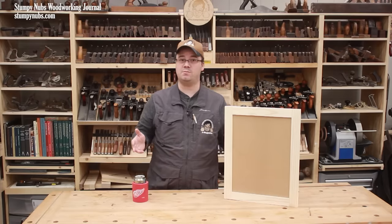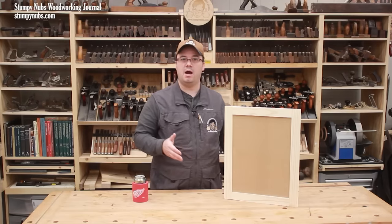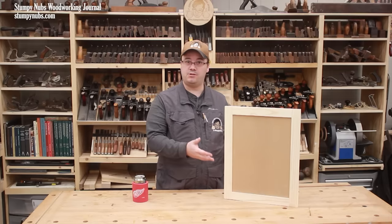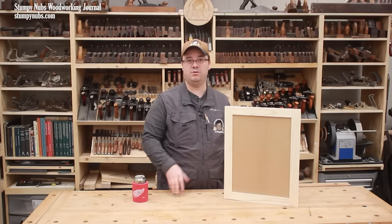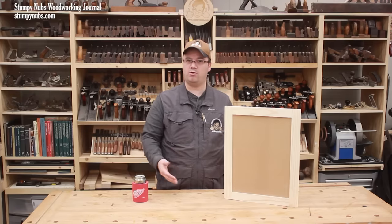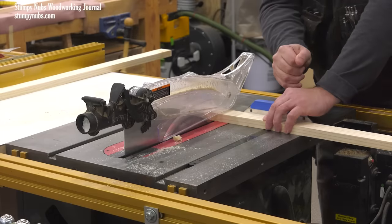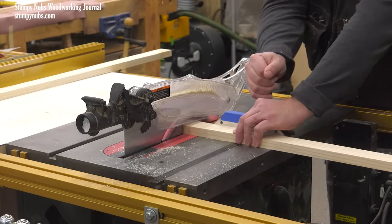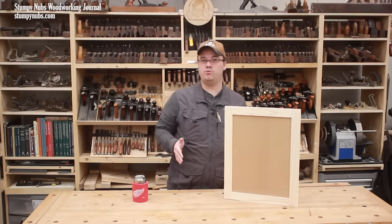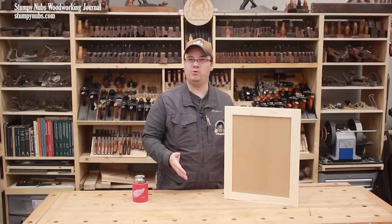Poplar is still a little too soft, especially for kitchen cabinets that you want to last many years. If it's available to you within your budget, a hardwood like maple is an excellent choice for natural stained or painted doors. Oak is also a good choice, though its open pores make it less attractive if you're going to paint. It's important to choose straight flat boards — you can cut around a few knots, but if you don't have a jointer or planer, you can't flatten a warped board. So take your time to pick them out, and also take care of your wood when you get it home.